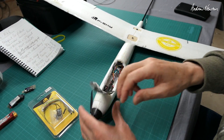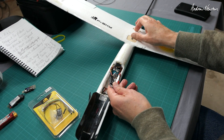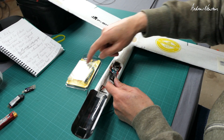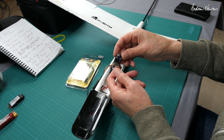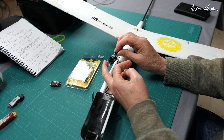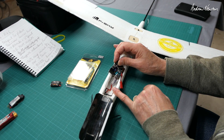Currently on the u-glider I have the separate high precision variometer sensor and an X6R receiver decased and buried under the wing. With the GRX6 I can bring all of that up front, or keep it under the wing with none of the extra stuff. Another useful thing is the LiPo sensor — you plug it into the balance port of your LiPo and get a live readout of voltage level, how much battery you've got left, and how many climb outs you've got left. Very useful.